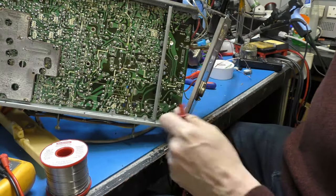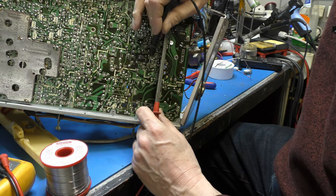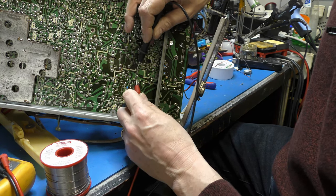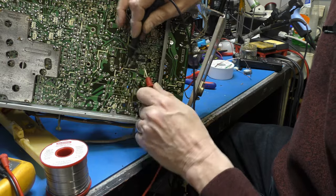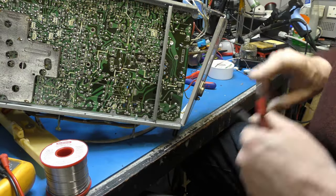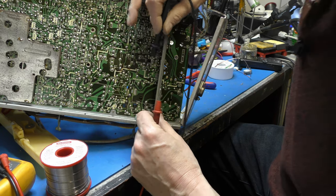Okay. So our power supply is down here. That's our big sort of capacitor. That's our glow lamp. That's that capacitor that failed. So I'm thinking, what do we got across there? Many kilo ohms. And I want to see where our... I need to see where that HT comes in. So that's it there.